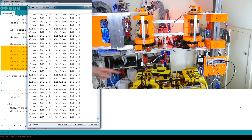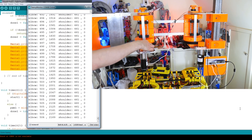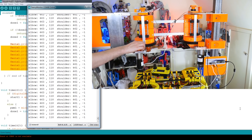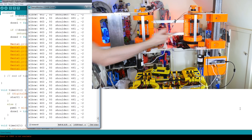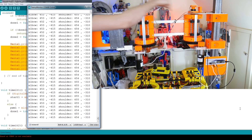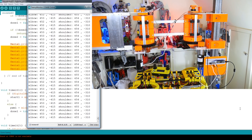When we first power up the Teensy, we're going to get values of zero because the motor encoders are not absolute — they basically count from when it was powered up. The magnetic encoders are absolute position, and I've calibrated them by positioning the magnet so that roughly when the arm is straight, we get a value of around 460 on each one. We've got the elbow and shoulder separated out — if I move the elbow motor, we should see both those values getting higher, and obviously lower if we move it the other way. But if I jam the motor and move the flexible section, we should see only the first value moving from the absolute position encoder. So once that's calibrated, we can work out the relative difference and how much force is being applied. On startup, we could drive those motors to get to a value where the arm is straight, zero out the non-absolute encoders so they're both calibrated, and go from there with our kinematic model.